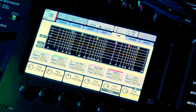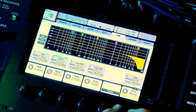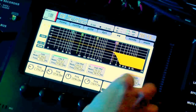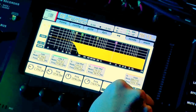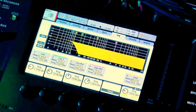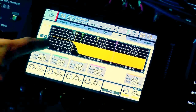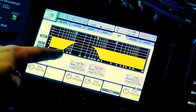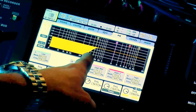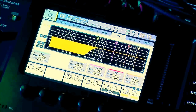We hit Matrix 5 and page back down to layer 4, go over to BU24, then page back up to the frequency and adjust all the way down to 100 Hz — that's where our sub cuts off. So now in the EQ section: the subwoofer cuts off at 100 Hz, the low frequency band starts at 100 Hz and cuts off at 500 Hz, and the mid/high frequency drivers start at 500 Hz and go all the way up. The EQ section is now finished.